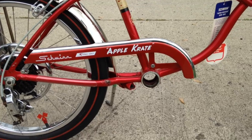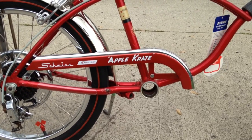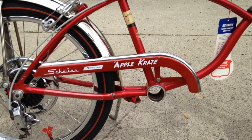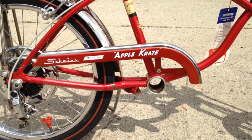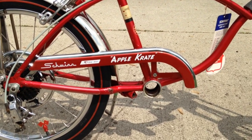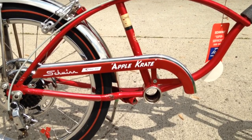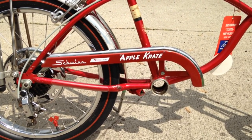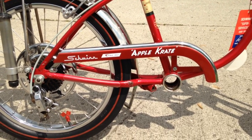Now the sprocket — I do have one, and I have the crank arms and the chain. But the problem was, and this is why I'm against re-chroming in a lot of senses, is that when I took my sprocket to get re-chromed, they made the teeth too thick and now it won't even accept the chain. So I'm out the money to have it re-chromed and I'm going to have to find a new sprocket in the best original shape I can. That goes with a lot of stuff — a lot of things I had re-chromed that have threads are now too thick and I had to re-tap a lot. Re-chroming is not always the best option. Sometimes you can save money by buying the best available original stuff, and it holds its value more because it's original.